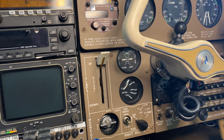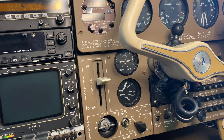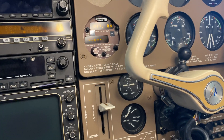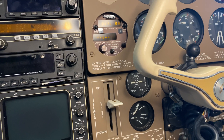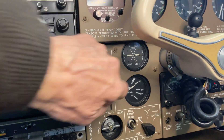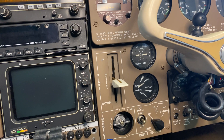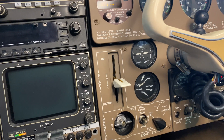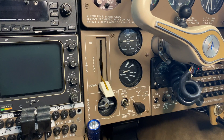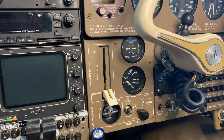It's a three-way position — the valve goes up, off, or down. Normal procedure is to put the flap handle back to neutral, which sets the valve basically to off. So the valve is up, off, or down — neutral meaning off. If I want to put the flaps back down to say 10 degrees, it takes about three seconds for every 10 degrees. I'll put it in the down position: one Mississippi, two Mississippi, three Mississippi — back to neutral. If I don't put it in neutral, the flaps would continue to go all the way down, which would not be good if I only wanted 10 or 20 degrees. You have to return it to neutral to stop the flow.